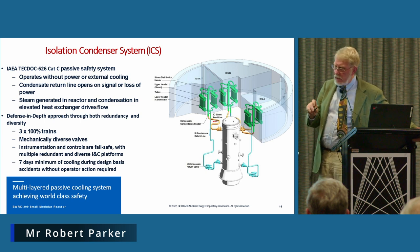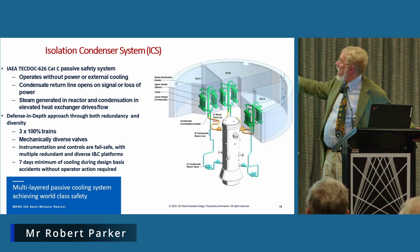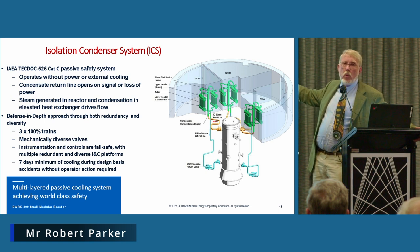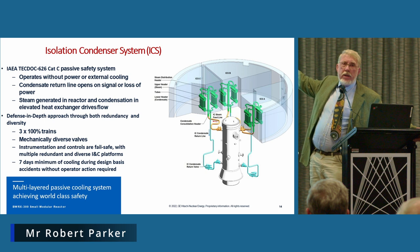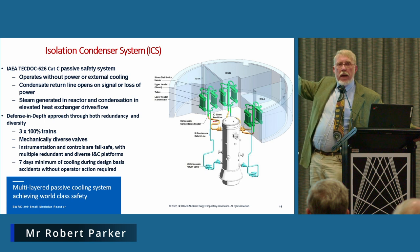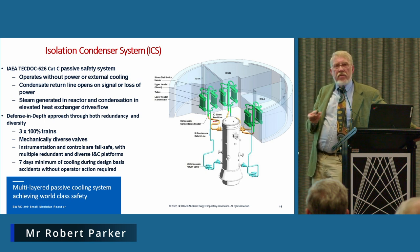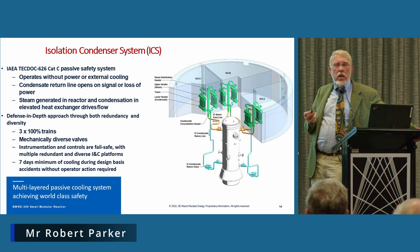In the event of a loss of coolant accident, the isolation valves close off the defective broken lines, while other valves open and enable water to flow up out of the top of the reactor pressure vessel into the water pool above, where it's condensed, then flows back down into the reactor, turns into steam, flows back up through the reactor, back up into the pond at the top where it condenses again, dispersing the heat through the pool. That mechanism enables them to get rid of decay heat for a period of seven days, after which they replenish the pond.